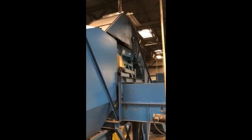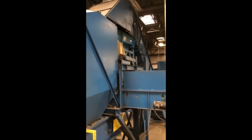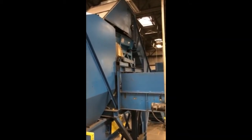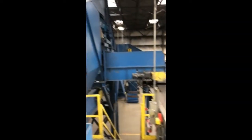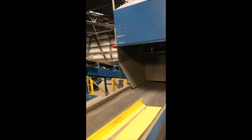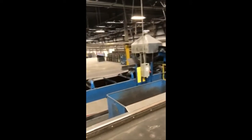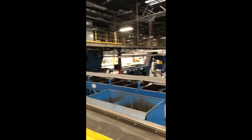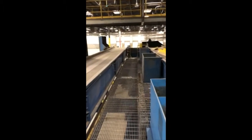This is the top of the conveyor coming out of the primary shredder. That kind of silver half moon thing in there is the drum magnet. It would take the magnetics down this sorting line, and the non-magnetics would come down this sorting line. The minus 3/4 inch materials came up this conveyor and bypassed the picking platform. This is a view from the drum magnet to the end.